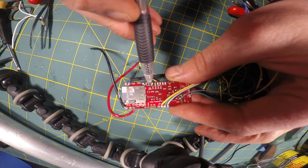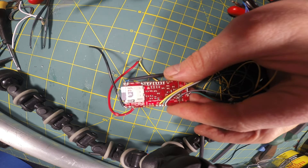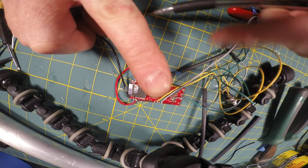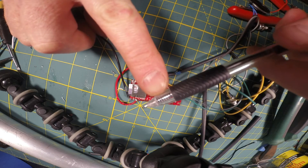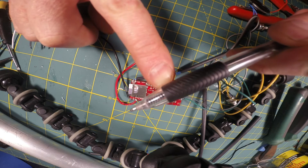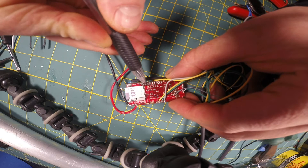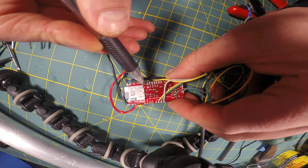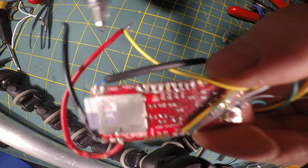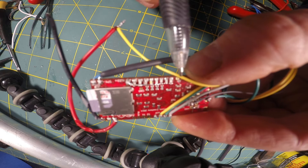You have to carefully maneuver that resistor tail so you're not touching the grounded SD holder or any other electronic components. Basically, I run this resistor tail on the upper edge of the SMD LED. If you imagine the SMD LED like a box, heavily magnified, the string on my positive is actually sitting on top of the SMD LEDs instead of sitting on the board. My positive line doesn't even touch the board — it's soldered to the top of each of these SMD LEDs. There are eight SMD LEDs all of different colors.